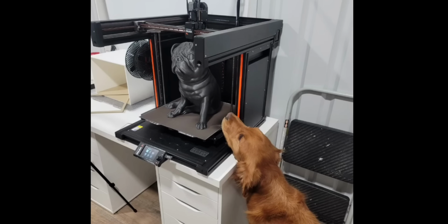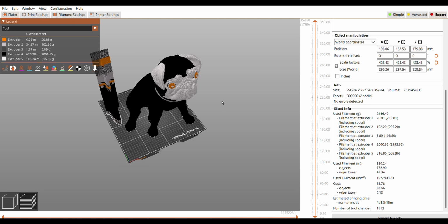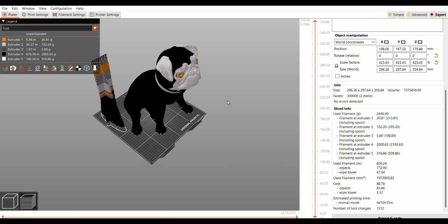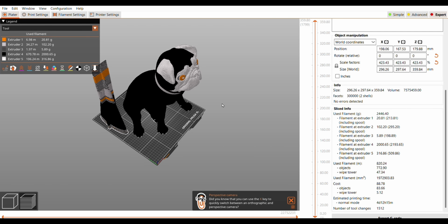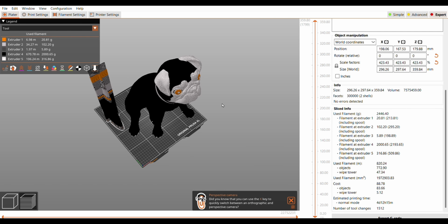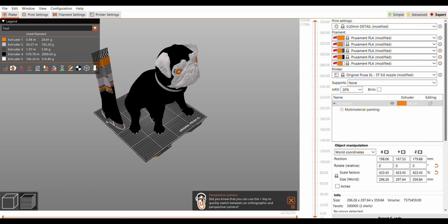So now I really want to try this on the 5 tool head with 5 colors. And I don't trust the G-code that came with my printer, so I downloaded it from Printables, and the download one does come already colored with the 5 colors, so it is ready to go. But the default that pulls up is going to take a lot of filament. The black alone is going to be over 2 rolls of filament, and I don't want to spend 4 days on this print. So I'm going to make some adjustments to speed it up,